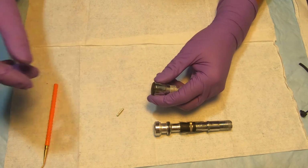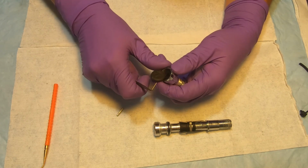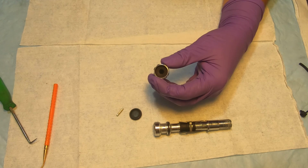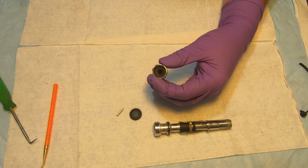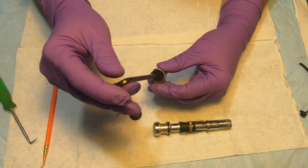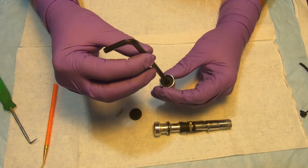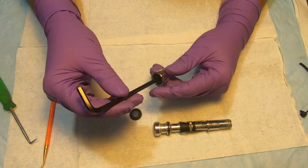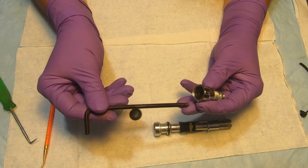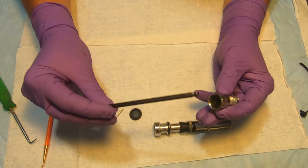So to access the screw, you have to remove this cover here, just the plastic cover. And then you can see here you have the hex that could be screwed in and out depending on how you will be adjusting our Venturi. Sorry, not Venturi, but cracking effort. We'll be doing that at the end of the video when we'll be reassembling and adjusting it. So this is, what size is that? Let me just double check. This is a 5mm hex.